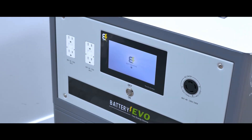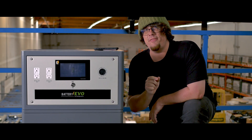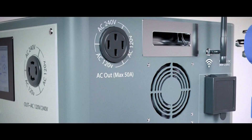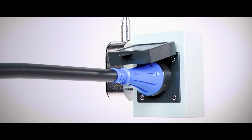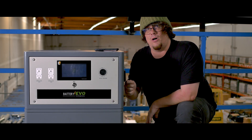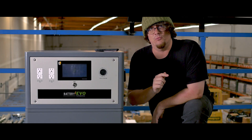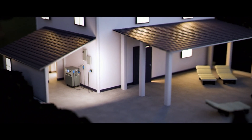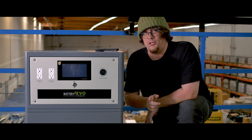The full how-to guide on how to install a Walrus into your home is on our YouTube channel. But one thing I want to mention here is to make sure that you have a sub-panel in your home. This is a simple, cheap install that every electrician is familiar with. Just get the sub-panel in and make sure you're running your power from your Walrus into that sub-panel instead of running it into your main grid. If you run power out of your Walrus into your main grid, you'll cause an energy loop, which can damage both your battery and your home. Don't do that.